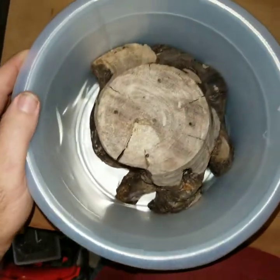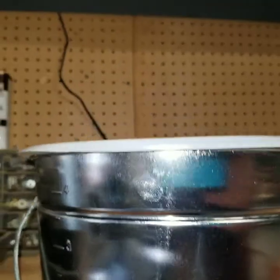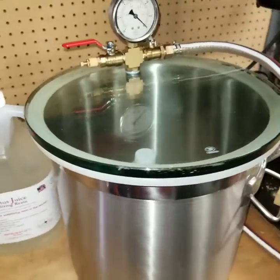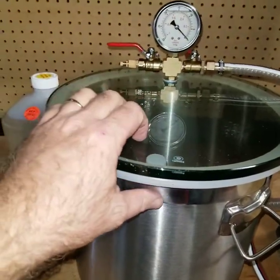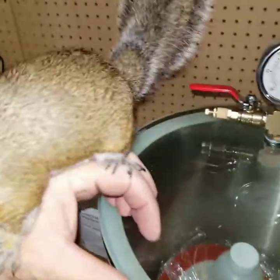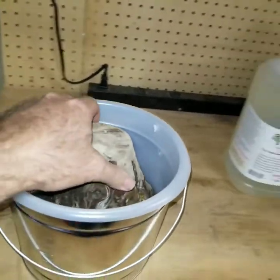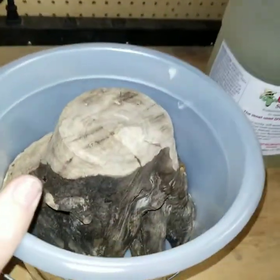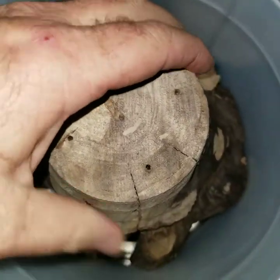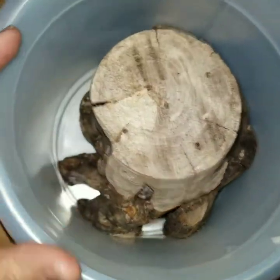I'm going to do that with the flash on — maybe it's a little bit better. You can see it just sits right down in there. I'd like it to be a little deeper because when you turn on the vacuum, we've got a vacuum chamber over here, with a glass top. I'm actually going to do resin casting on this stump and fill these voids with a casting resin after stabilizing.